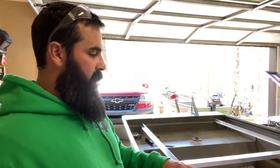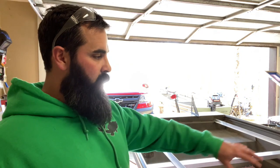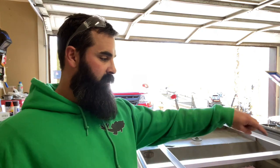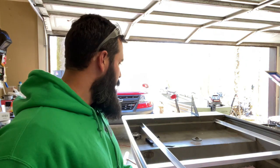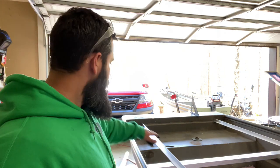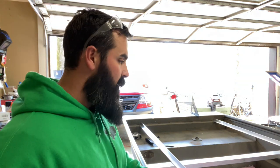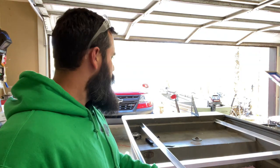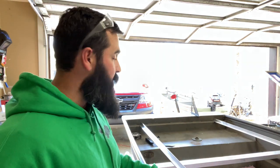So once Jacob gets these braces welded in, I'm going to go back and put in some dog legs on each side, and then maybe some of this channel all the way across. Probably go with something thin, like some 1/16, something I can pick up from Lowe's, because I'm going to be pop riveting it in. And that should make everything super sturdy, I think.